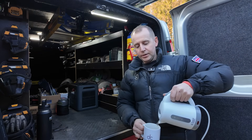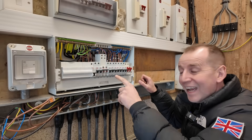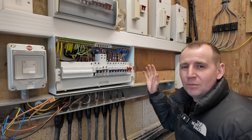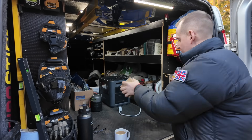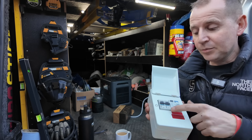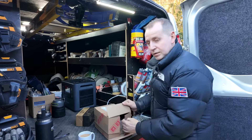There are a couple of bits I need to install now, which involves a little bit of hoping for the best. One is we have an old Wylex board in here. I cannot get RCBOs for it — I've tried loads of wholesalers, no one can get them, they don't make them anymore, and I don't really want to buy any off eBay second hand. So I've got this little Proteus — it's a little EV garage consumer unit — and inside we've got a 40-amp RCBO, a B16 breaker, and a B6 breaker. So this is going to go there.